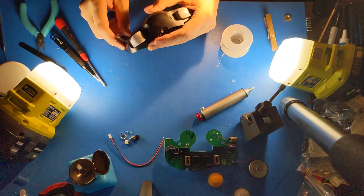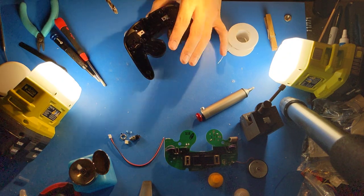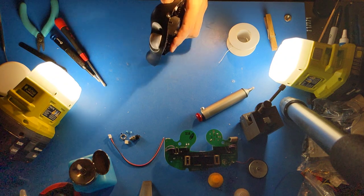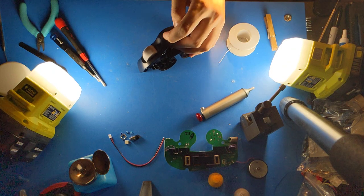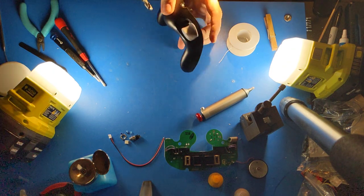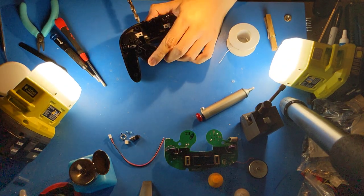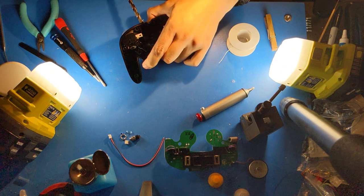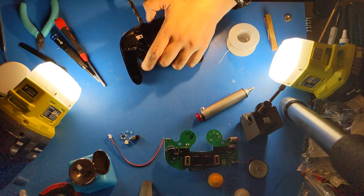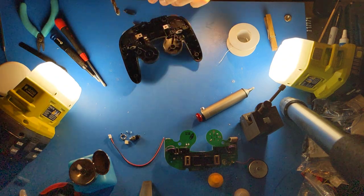Next, I will be drilling a hole to install PhobVision. So you need to drill the hole centered on this pin, 1/2 inch or 13 millimeters downward from the edge of the shell. I do this freehand, but if it's your first time, I suggest you measure it. It's very good to use a split point bit because it won't wander as you're drilling in. Start slow, and then speed up, apply pressure gently, and you'll drill a hole.